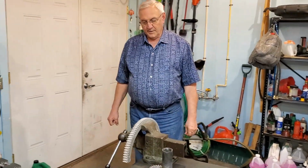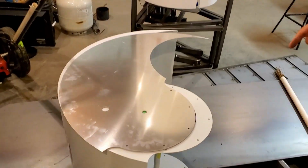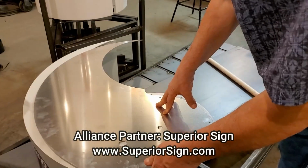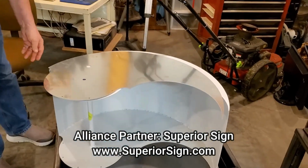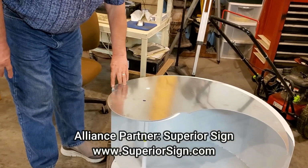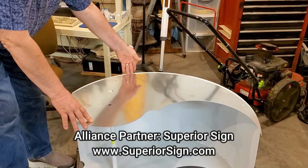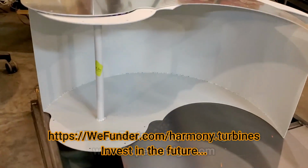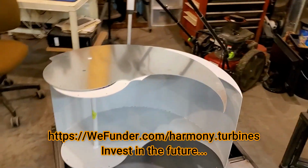Have them cut the rest of them. You get the scoops made over there. These are the scoops. This is the yin and yang part. Water jetted out, and then I'm going to fabricate the outside perimeter of it. What is that size that we were using in the old one? 63? Yeah, 063, and we'll come around and I'll have a 90 pin on it here in that little notch. We'll have a 90 at that end, and that'll give some more rigidity to it. And that'll be right tight against here and then welded solid the whole way, and up underneath, just like this one is. Beautiful. And then you're going to prime and paint them. Prime painted. And I think they'll do the job. I think they're going to go together really, really well.